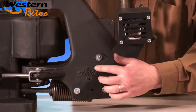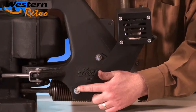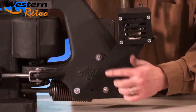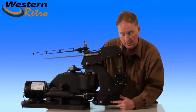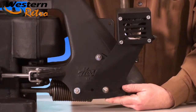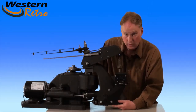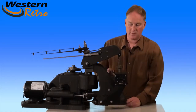We recommend using at least three bolts: one here on the outer edge, one here on this edge, and one up top here. Take a quarter-inch drill bit once you've marked the position of your holes. It's also recommended to put a clamp here so that you can secure the bracket to the X3. Drill your holes, install your bolts, and then you can move the elevation linkage.